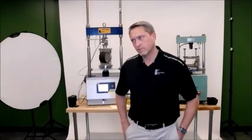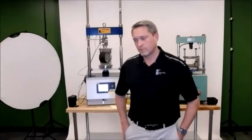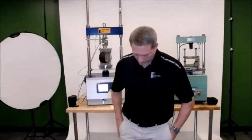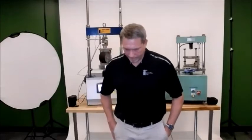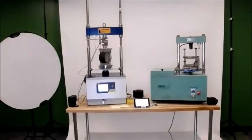I truly believe that as long as these states are addicted to single lift rehabilitation techniques, what is achieved with this process is extremely valuable, to be able to eliminate the cracking and still carry the load. Our feeling in Region 5 is we don't like to lay single lifts. We always do multiple lifts to achieve the same thing. We've had a tremendous reduction in cracking, but that's because we provide a flexible interlayer underneath.